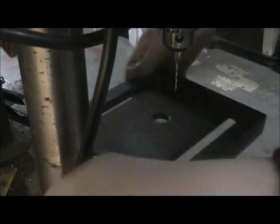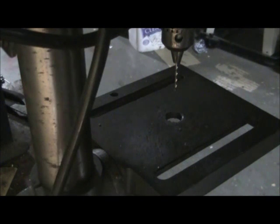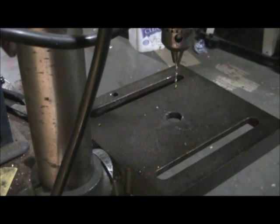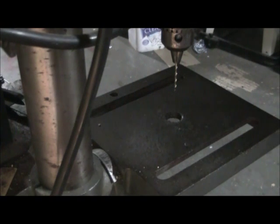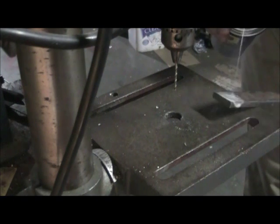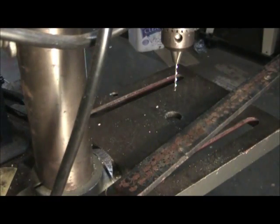Get your piece and line up your itty-bitty drill bit with the hole so that way you don't drill a hole into your plate. Now get your safety glasses and put them on. You need to have some oil — since I don't have very good oil, I'm just going to use some WD-40, which works. It's multi-purpose. But cutting fluid or anything like that works well too.